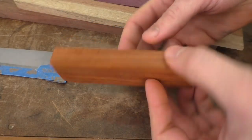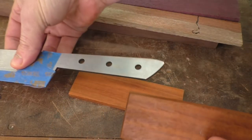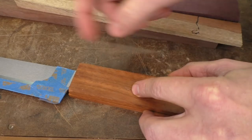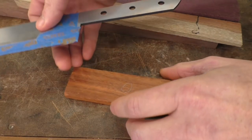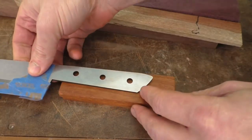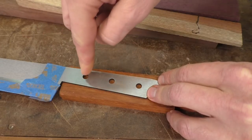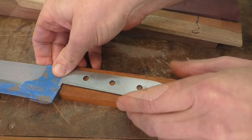I've got the outside marked on my pieces, so the knife will go together with one scale on each side — that will be the handle. The next step is to put these pieces in order with the tang on top and tape the whole stack together so we can drill through the handle pieces to align everything.